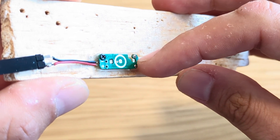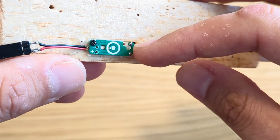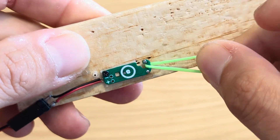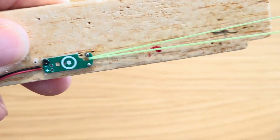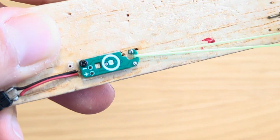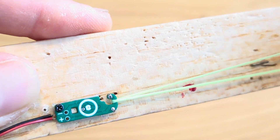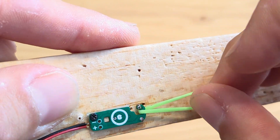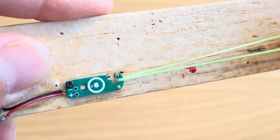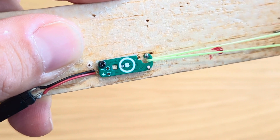The burner is here. It's protected by the PCB itself, so you can insert the rubber band and pull it as strong as you want — it will not break the burner wire because it's supported by the PCB. You should put it with a strong tension — it's better for the rubber to be reliably burned.